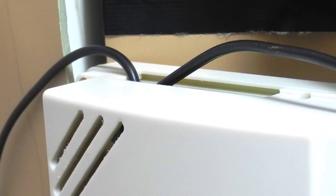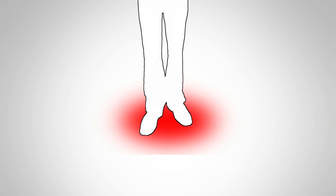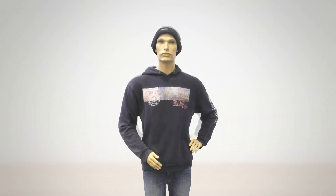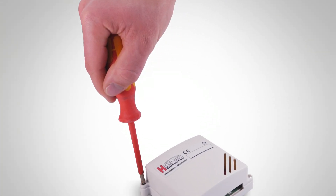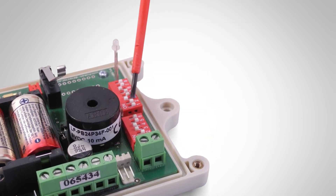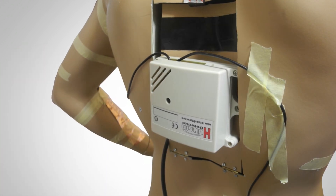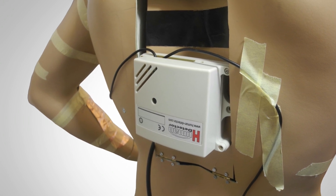Now you have to connect the cable with the Human Detector module. A ground plane will be put underneath the figurine — this could be, for example, a copper foil under the stand of the figurine. Now the work is done. If everything is installed you have to put in the batteries and switch the right adjustment. How to do this will be explained in our user manual. Now everything is ready and you could close the Human Detector again.